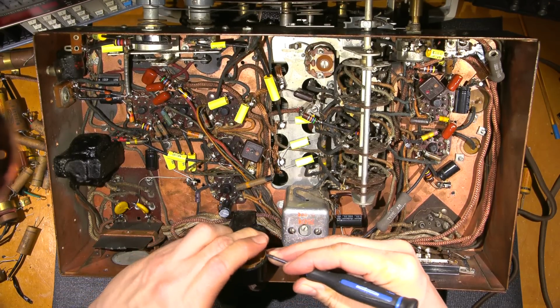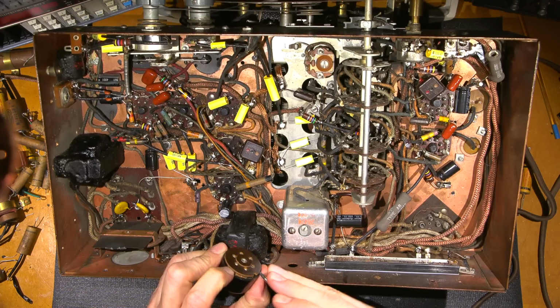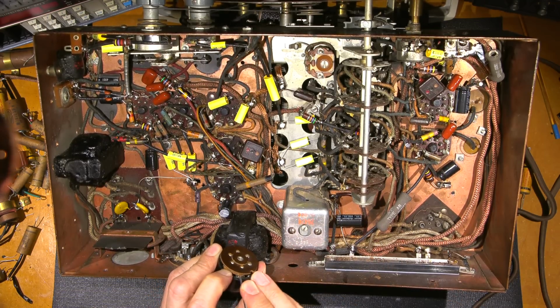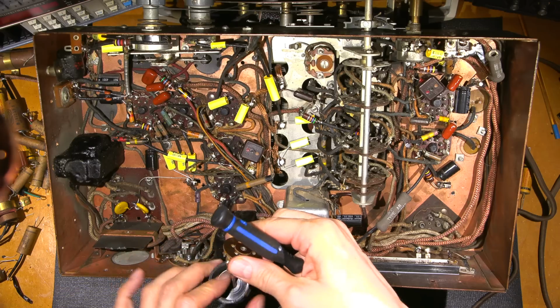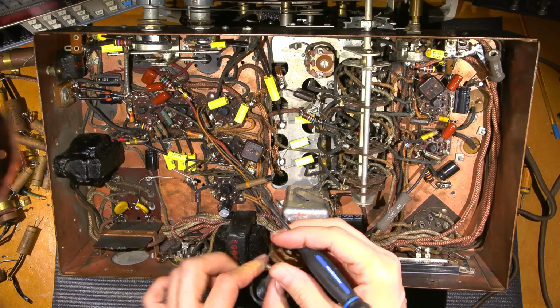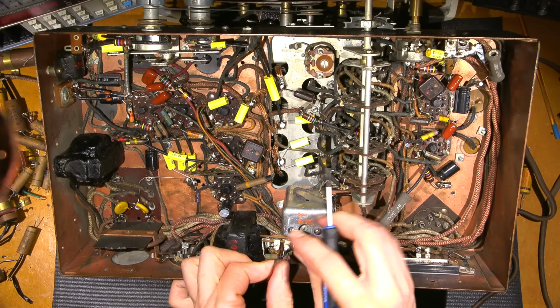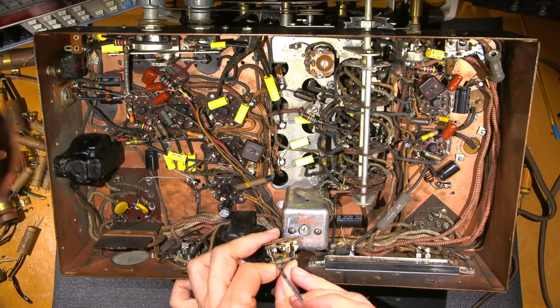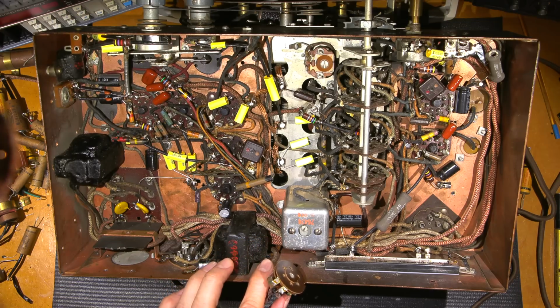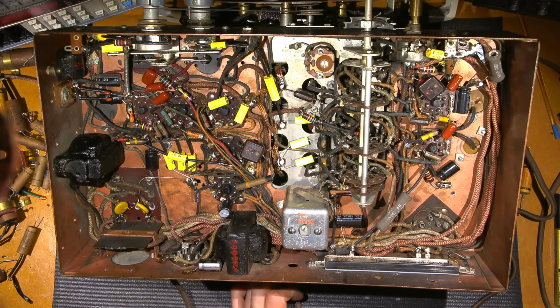Yeah, it's pretty tight, all right. Let's see if I can get behind the second layer here. That should give me a little bit of leverage. There it is. Okay, there is that hiding resistor. That's 1 megohm. Again, body, end, dot: brown is 1, black is 0, and green is 5 zeros. That's 1 million ohms.